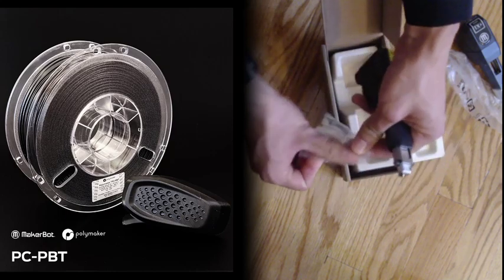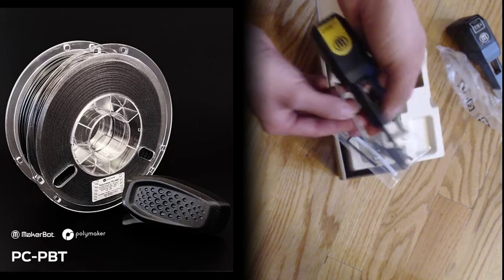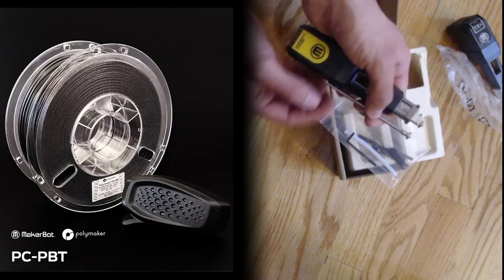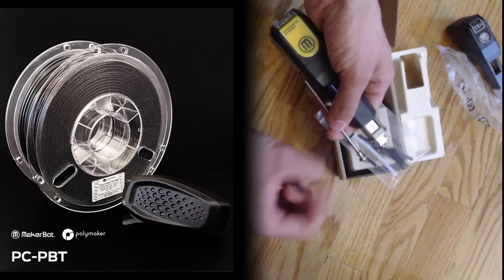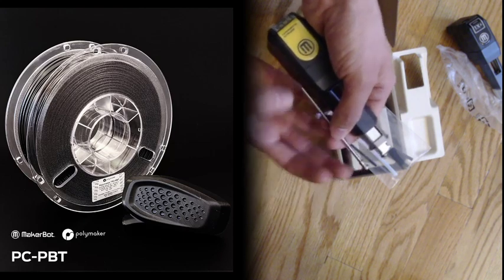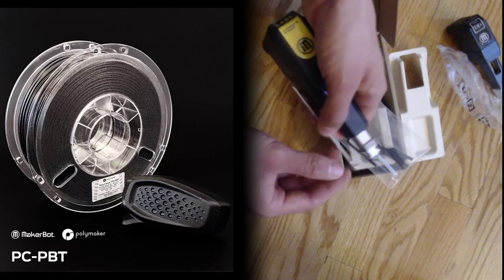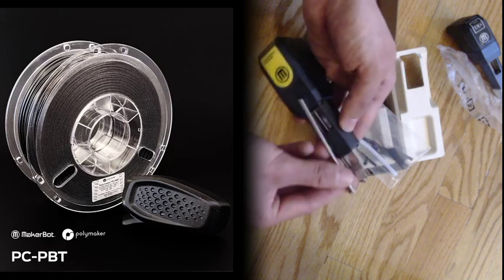So let me get the nozzle out for a second. That's one other thing that most people don't realize, how much more comprehensive the system is. I don't think that there's that many printers out there that offer such a long nozzle pipe. The reason for that is not only aesthetic, but it's actually because we want to better control the way that the material is heated up. So instead of just having a super short nozzle that immediately saps the material and melts it right away, which can challenge the way that you can control the flow, we actually have a much more even distribution of the heat in the nozzle. Specifically, our nozzle is about 3 times as long. The heated element is about 3 times as long as a standard extruder. And this extended pipe just guarantees that the material is going to be much more evenly flowing through the nozzle, right? So the whole nozzle is in there.